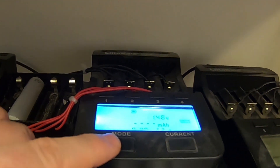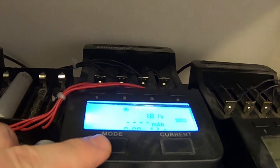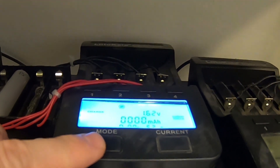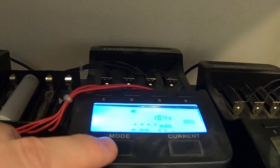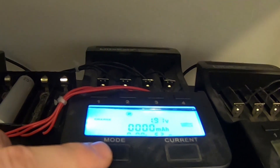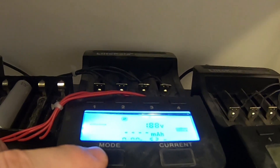We're not happy with 1.6 volts because the charger thinks it's a NiMH battery, and NiMH batteries are fully charged at 1.5 volts. It still thinks it's a NiMH battery. Checking the voltage — 1.62 volts. Is this NiMH? Let's trickle charge it a little bit. It's detecting as some unknown cell. The cell is at 1.74 volts now — could it be NiMH? Let's trickle it and see how much resistance it gives.